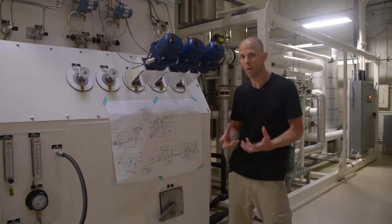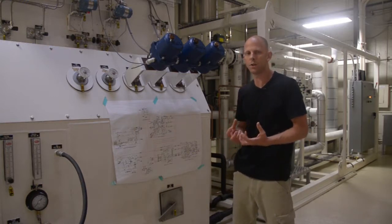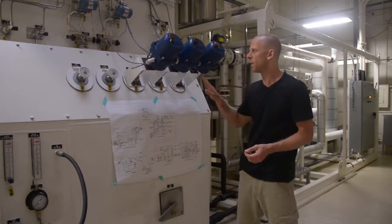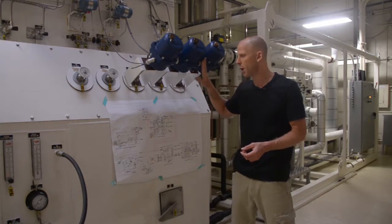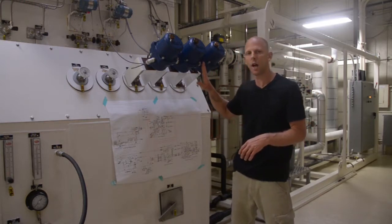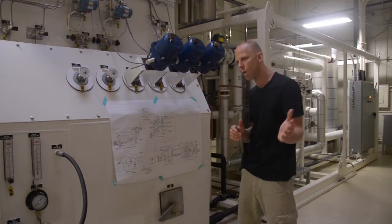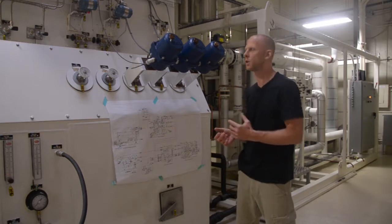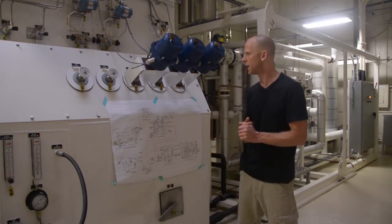If we find we're having a problem with purity, we just cannot get oxygen or nitrogen purity, it's probably a good indication that you're not getting enough process air, liquefied air, making its way into the columns. So we can try to raise our set point on our column, put more air and liquid to the column itself, and thereby help our purity.